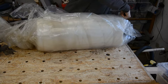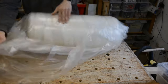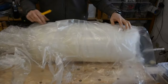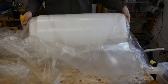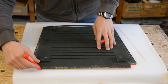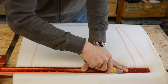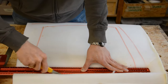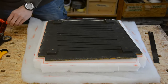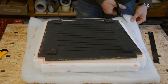Before finishing the wood, let's have a look at the upholstery part. I never did any upholstery before, so if you have a good tip please leave a comment. I got 60mm foam from Amazon — if you want the same material I have links in the description. The foam is cut to the shape of the seat with a centimeter or a quarter of an inch overhang on each side. Over the foam I put batting, which ensures that the fabric is not rubbing against the foam and thereby destroying it.